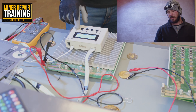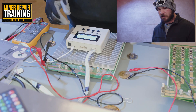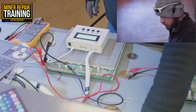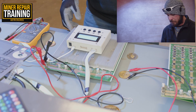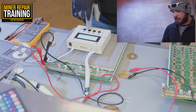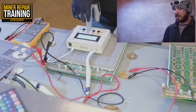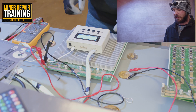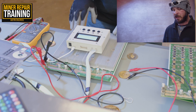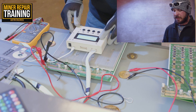You can see that it actually tests the EEPROM and it'll also test the PIC. Go ahead and power on the variable power supply, then hit the B3 button — that'll turn on the test. As you can see, it already found all 76 ASICs. It gives you up to 100 seconds to test before you have to hit the test button again.